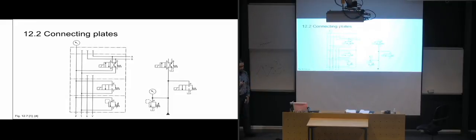Right, on the following diagram that we have here, we've basically put up the functions of 3 valves. So we have the pump down here. It's delivering pressure into a line. It's going to a pressure reducing valve, a pressure relief valve, in order to handle if we get any pressure peaks or anything like that. We don't want to have too high of a pressure.